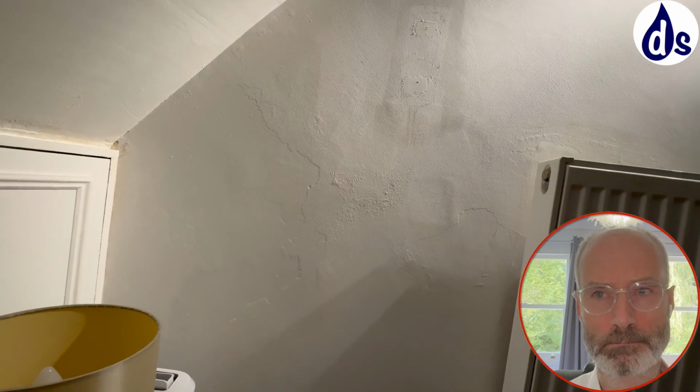And you're drying clothes upstairs in the same area, and vapor moves through diffusion like smoke. If somebody was smoking upstairs, you would soon smell it down here. So if you are drying clothes, I would use a dehumidifier next to them, or try and dry them outside as much as possible. But that's not so easy in this country. Not at the minute, no.